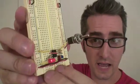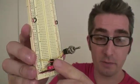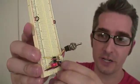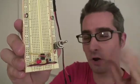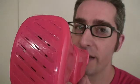Let's start with stage one: a blinking light. What's happening here is power is flowing through the resistors and filling up the capacitors. The timer chip notices when they're full and then switches them so they release their energy. They light up the LED, and this happens over and over again so that the LED flashes.